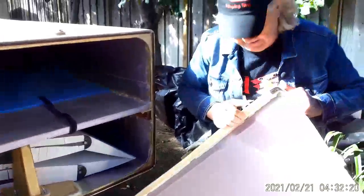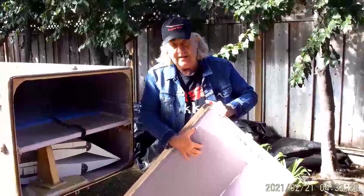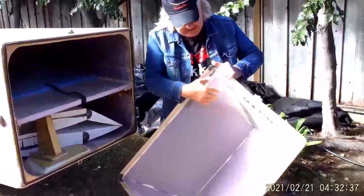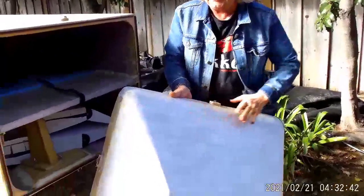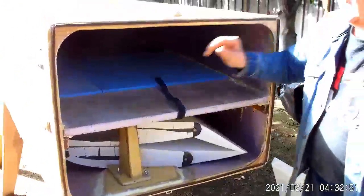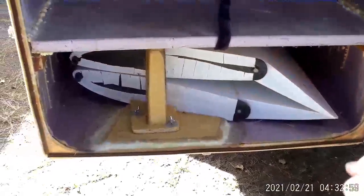The whole box is built out of one-inch thick DOW styrofoam — this is extruded polystyrene. I generally glue these panels together with urethane foam-in-place, the stuff you normally use for insulation. Around the outside, we have one layer of six-ounce fiberglass. Then I built a flange on the end here to go over the outside — that's how the entire box is built. On the end, I have a half-inch thick plywood frame that rigidizes the end of the box, and the fiberglass is wrapped around that, making it a nice rigid box side to side.